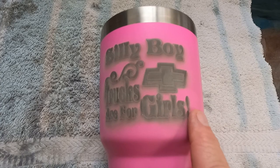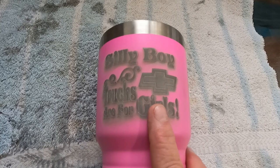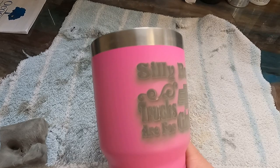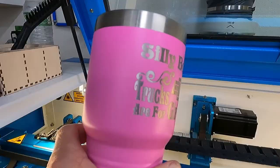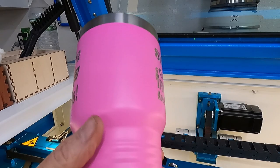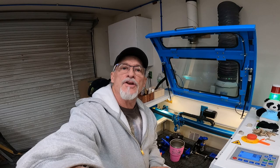After engraving, you've got a lot of residue to wipe off. Get yourself some LA Awesome from the dollar store — spray it down, let it sit for a minute, then use a magic eraser and scrub the stainless. Your design will come out great. You can see there's a design on this side and a design on this side — they're pretty much opposing. Just like that, you've got a nice tumbler with a design on both sides. It took about six and a half minutes to do this 30-ounce tumbler, and they shine up nice. Tumblers are not really hard to do once you get your rotary set up right and your template dialed in. I hope this information was helpful — please like and subscribe. Until next time, have a great day.